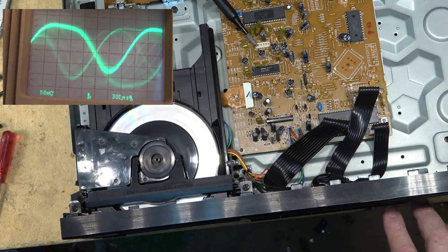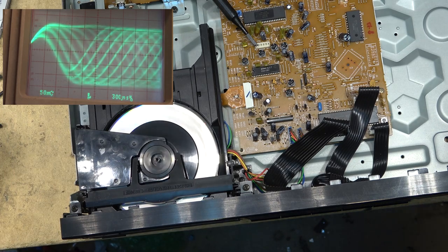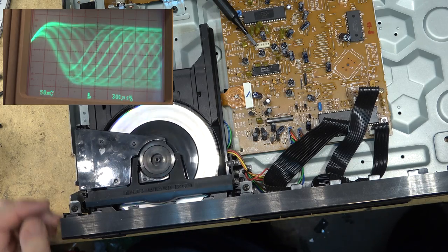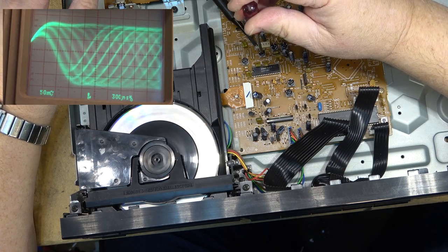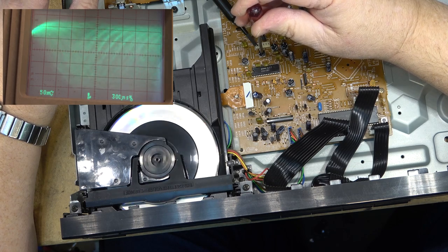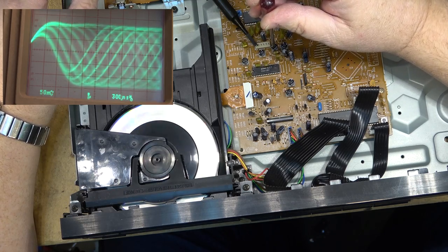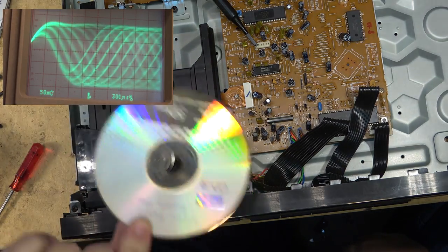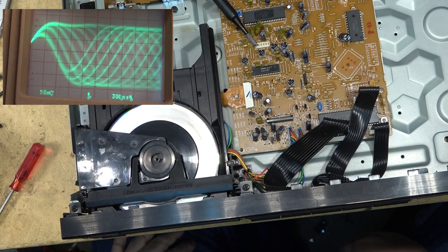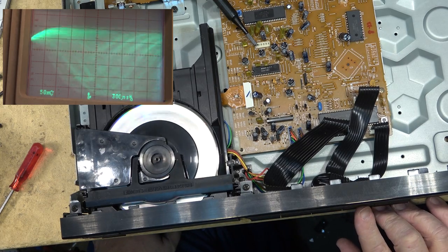See, this is the disc that I had on there. Let's see if this one will read. Okay, now we're getting some noise. So now we're going to tweak this one. Try to get this one to give us the best. That's why it's important to use different discs, because different discs have different characteristics, especially when you're dealing with CDRs on these old players. And this one is a fairly old player, a PD4300. 4 times oversample digital filter. Let's see how we can search tracks out.